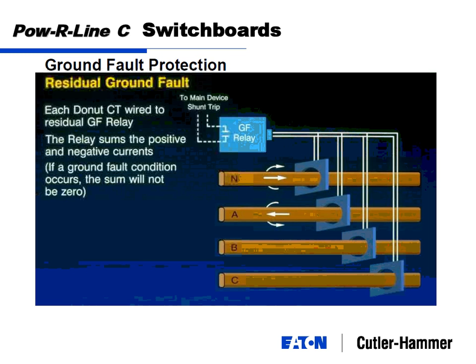Okay, the residual, which is how circuit breakers are done. So the zero sequence scheme I showed you for reference; a circuit breaker trip unit is done this way. I've got a CT around C phase, around B phase, around A phase, and then one that you have to pull your neutral through. Okay, for the neutral on a circuit breaker, how many poles do you guys see here? One. Okay, I see three. A phase, B phase, C phase.